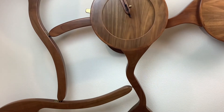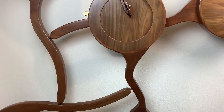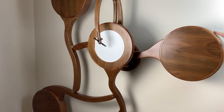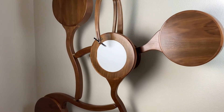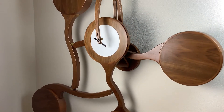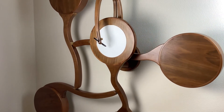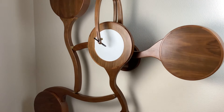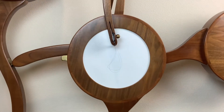I also wanted the pendulums to swing slower than might be expected, considering the relatively short lengths of the pendulum bars. The design targets were a 5-second period for the first two pendulums and a 2.5-second period for the last two pendulums. Since the pendulums are tightly coupled, energy is transferred between them. If any one of the pendulums is moved, the other three will soon be moving. When all of the pendulums are moving, energy is continually transferred between them. This tight coupling also makes all of the periods unstable for ratios other than 1 to 1. I initially used a stopwatch to measure the periods while tuning, but this took a long time to get accurate measurements and these were not reproducible. I finally mounted an accelerometer on each pendulum to precisely measure its period. This verified the instability of the system. All of the drawings have similar shapes from one cycle to the next, but these change significantly each cycle, so there is a lot of irregular space between the lines.